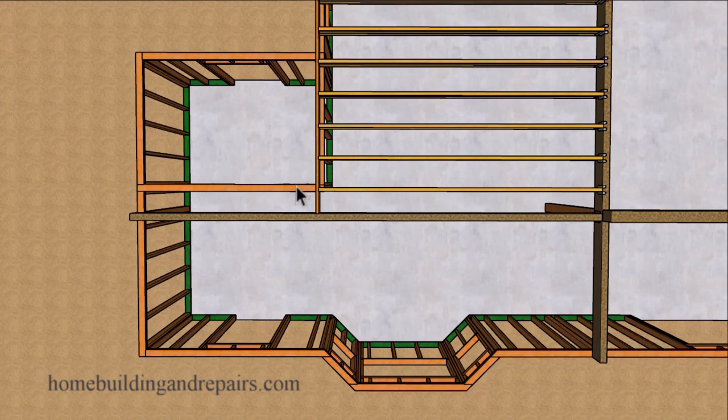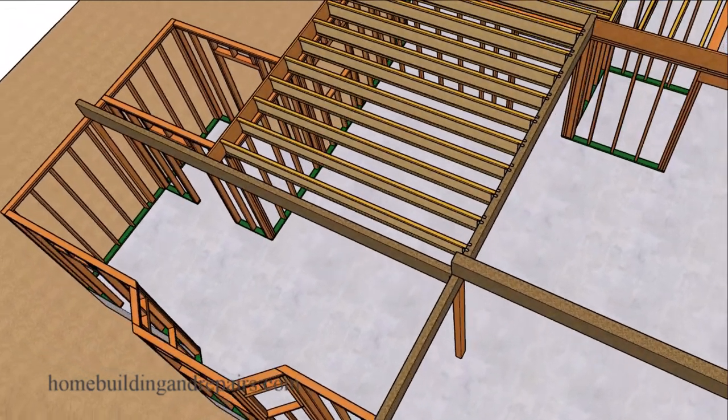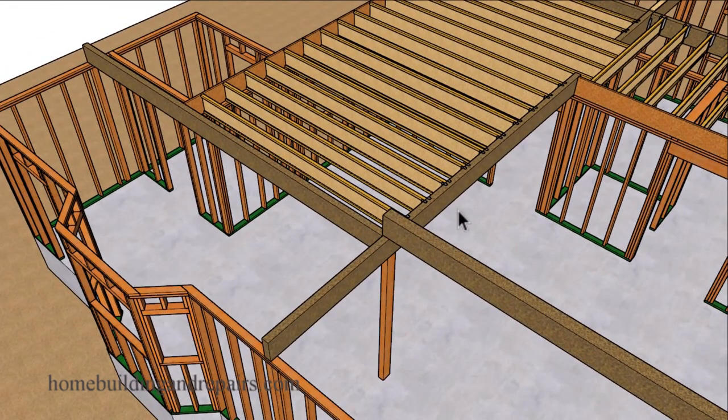You might be able to move the wall and have it sit under the beam, then simply put a structural footing in the floor foundation to transfer that load down to the ground. You can get a good idea of how the beams are supported to create open spaces in the lower floor. This beam is basically going to tie into the other beam to create some type of structural drag, using beams to connect one side of the house to the other.